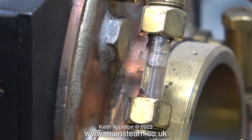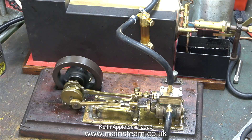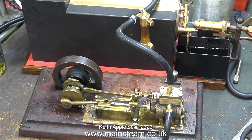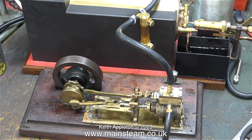Because the engine isn't wasting as much steam as in the previous steam test, I did notice that the water level remained quite high in the boiler most of the time. I only had to use the hand pump near the end of the test as the water level naturally dropped.